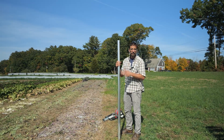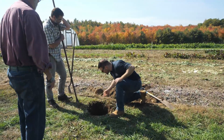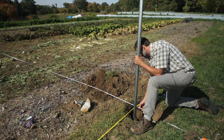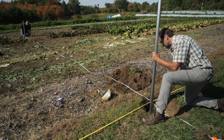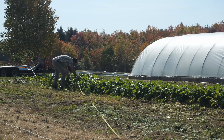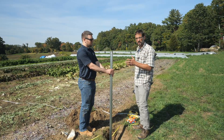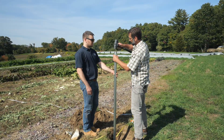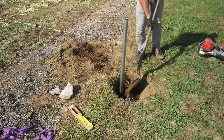This being a corner post, we want a full embedment on it, so we've actually chosen to dig out and remove this rock. Now that we've dug the rock out, we're going to reposition this post just like we did before — centered on 30 feet in the width direction and centered on 96 feet in the length. We'll check the diagonal before we drive it too far. We're one inch off, but the manufacturer's recommendations give tolerances for how far off the diagonal can be. Now that our diagonal is within those tolerances, we'll get this one started and drive it like the others, level it like the others, and then backfill and tamp the soil down good and firm.